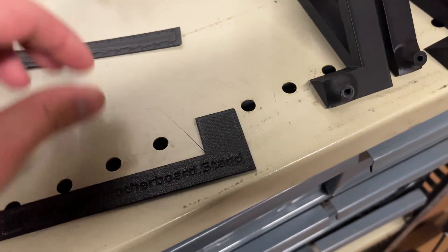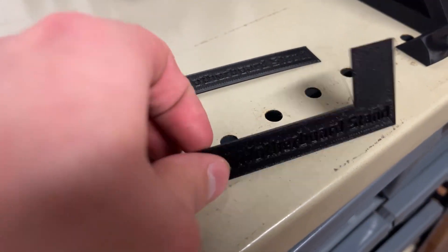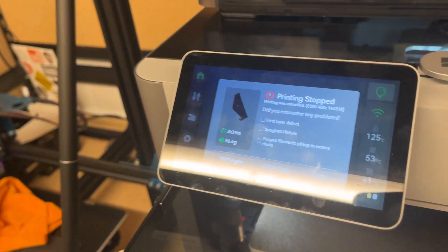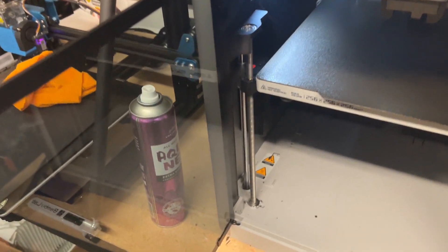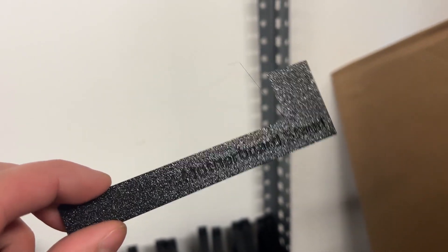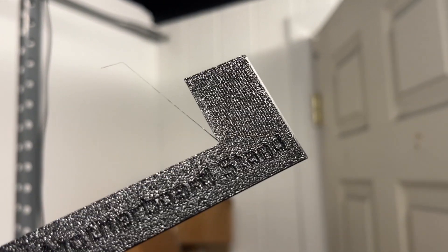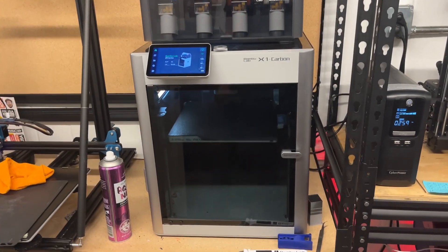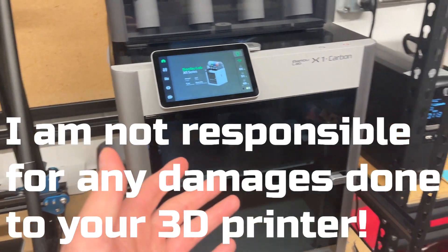So this is at 0.2 — that's actually pretty good, I like that. This gives me a lot of confidence. If I add the QR codes to the sheet, Bambu won't alert me every time that the sheet doesn't match. I'll also use some hairspray just in case for really tall objects. I might go up another 0.01. So that's how you change your Z offset — there's no manual adjustment while printing, you have to do it from the G-code. Hopefully that helped, and thank you for watching.